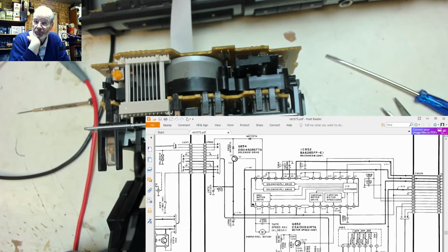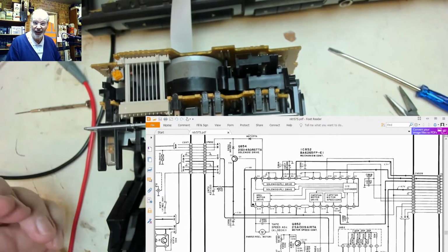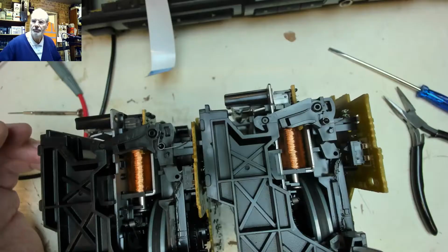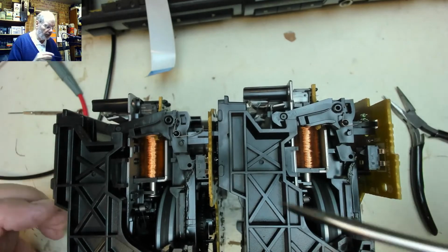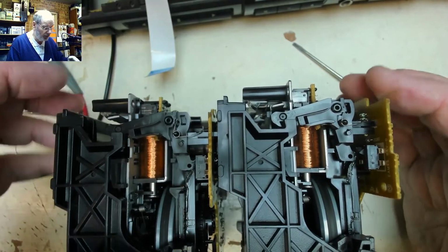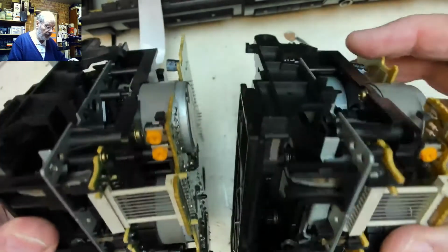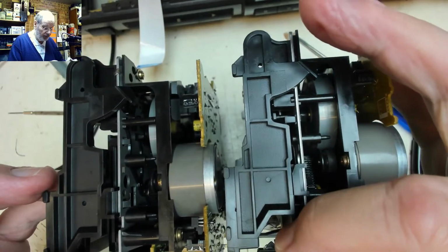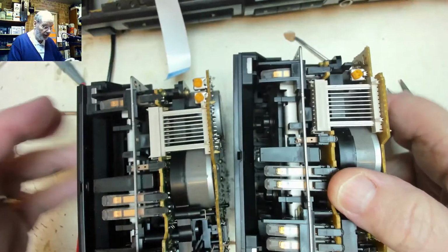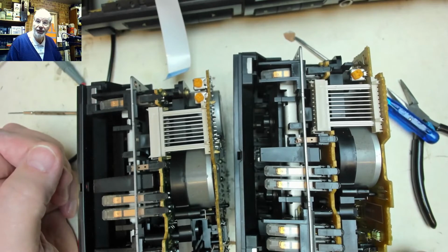So we found it. My guess is that something got jammed in there, something got taken out maybe, or just literally it was left in one position for so long. I don't know. The two metal bars there and there look the same. This is B deck. It's quite loose. It's quite stiff. Everything else looks okay. That end looks okay. So just literally that mode switch there somehow got bent up, was making connection all the time.